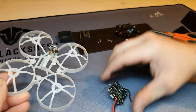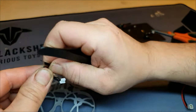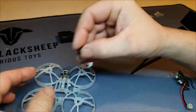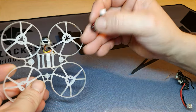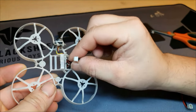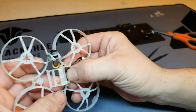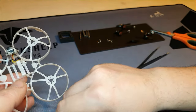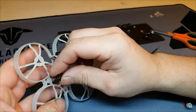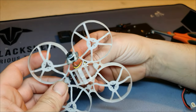Are you feeling up for it? Just one more thing. If you take your board out and direct solder the wires, you have to be able to get the board and the motors back into your frame, and that's hard. Most frames don't have holes big enough to fit the motors through when reassembling your drone. So figure this out before you start soldering, take into account the length of wire you need, and keep a bit of slack. Because when crashing, your frame will flex, and if your wires are too short, you could rip off a pad from your board.